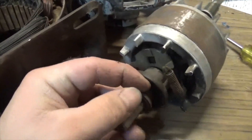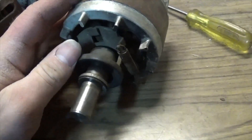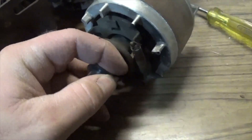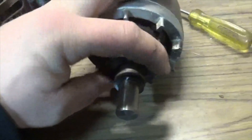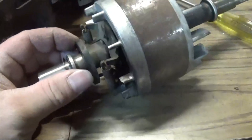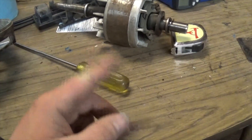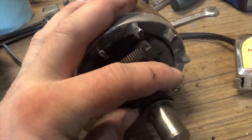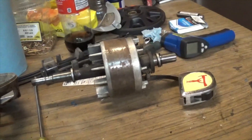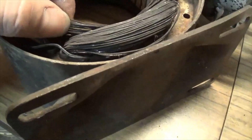I'm starting to wonder if maybe the centrifugal switch was stuck. I can't remember if it was stuck when I first looked at it. In the video, the first time I ever actuated it, it looked like it was a little bit sticky - nothing horrendous. As you can see now it is kind of hard to push back but it's definitely functioning. I could give that a quick spray with WD-40. While editing the video, you couldn't hear that centrifugal switch clicking - maybe the motor just wasn't spinning fast enough to throw those weights out, or maybe it was sticking.